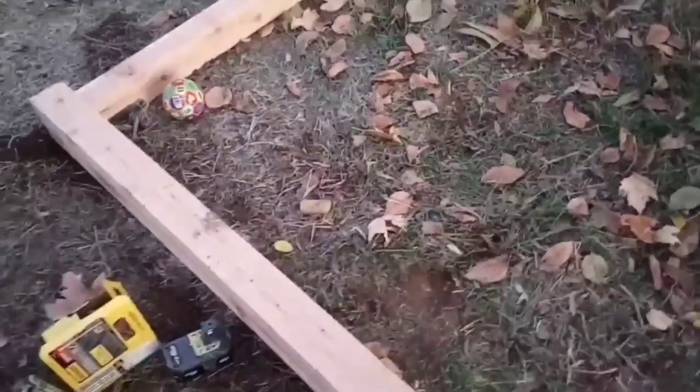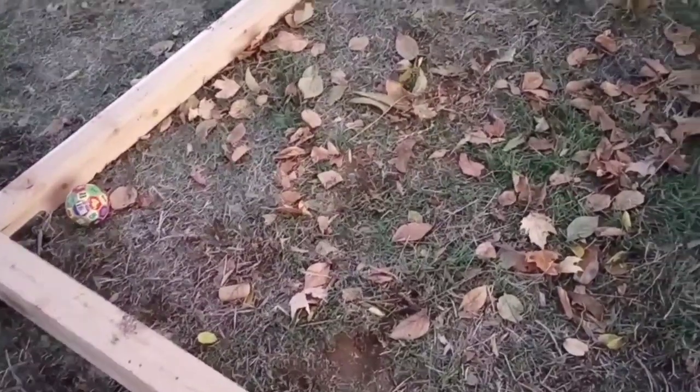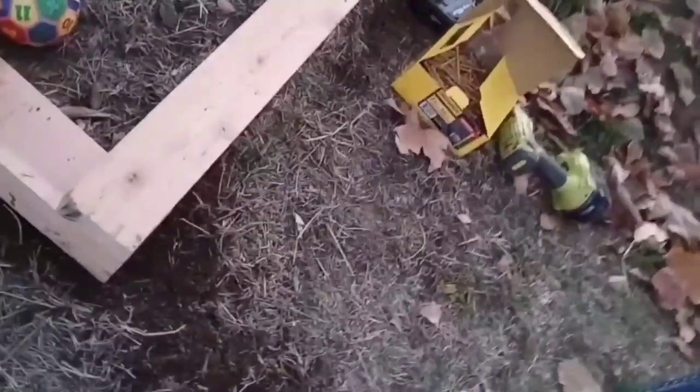Those corner bracket 90s and each of the boards being exactly 12 feet should handle most of that for you. We were off about an inch, so the way you check is diagonal measurements. You know the frame is square if the diagonal distances match. Make sure you measure inside corner to inside corner or outside corner to outside corner, and adjust it until it's exactly right. Then you're going to fix it in place by screwing down through the top of this 4x6 into the bottom plate. I use nails on the bottom side and screws up here.